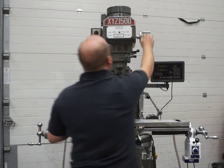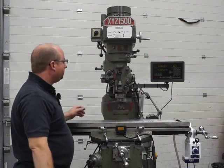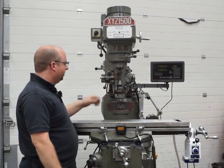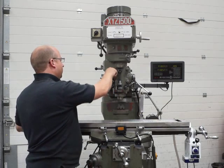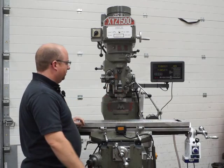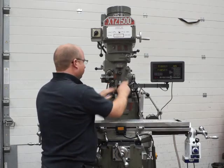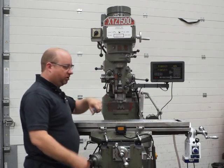We're running at 1400 rpm again. We're going to engage the quill and watch the feed come down — it's actually going up at the moment, so I'll knock that off and reverse it. You can knock the feed off with two fingers. I'll let it come all the way down.